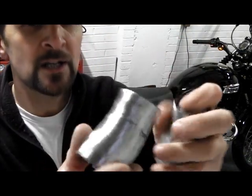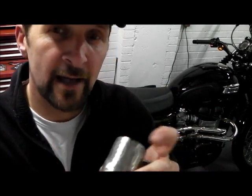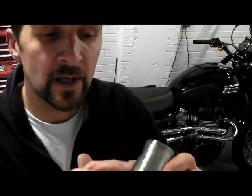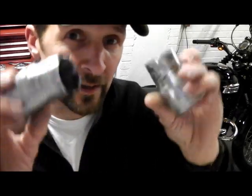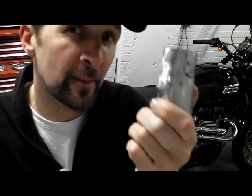Last night I didn't do a video. I just spent some time on these, just finessing them, tack welding in the little pinholes, with a hand on the back, blowing the top, little tiny pinholes here and there where when you've migged it you do get little gaps. So they're all sealed now, they're completely gas tight. I could have gone further and just kept sanding them and make them all shiny, but it doesn't matter, they're going to be painted black anyway.